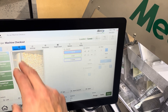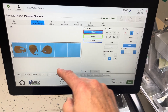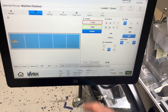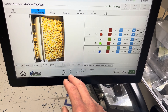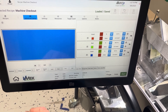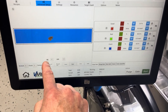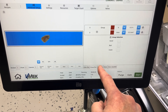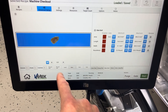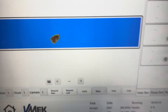We've also made many improvements to the sorting ability. For our color classifiers, they're much easier to train by dropping seed, and you can adjust them more easily. We have the visualization ability as before — if I want to catch a seed, drop it down the chute, I have the ability to zoom in on that seed and see all the values for it, which helps me adjust settings easier. The images are also a higher quality, better fidelity.